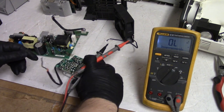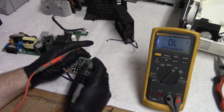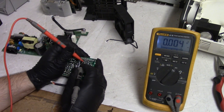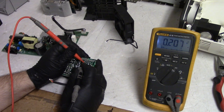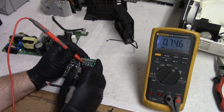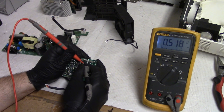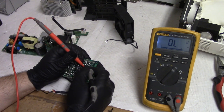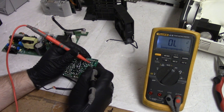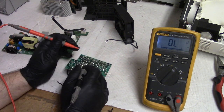All right, let's check the MOSFETs first. They're probably N-channel. So that means I'll go from gate to source, gate to drain. Okay, must have been tapping that with my probe. Alright, that's what I want to see. I think we should see the, yep, there's the flyback diode. So that's good. So that looks to be what we're looking for. Make sure there's no short circuit, and doesn't seem like it. No, those are good. Those are good.